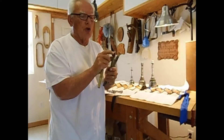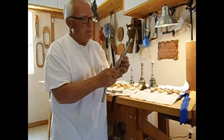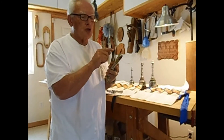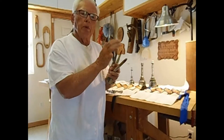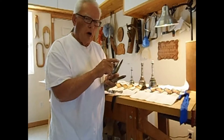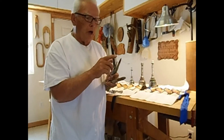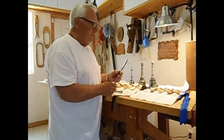This is another chisel that would break if I hit it very hard. The way they make these chisels, they have tungsten carbide tips that are brazed on. Where this chisel broke is I broke the brazing, so I had to re-braze it. The thing is with tungsten carbide — if you hit it too hard it is brittle and it will chip, so many times you chip the carbide right on the chisel.